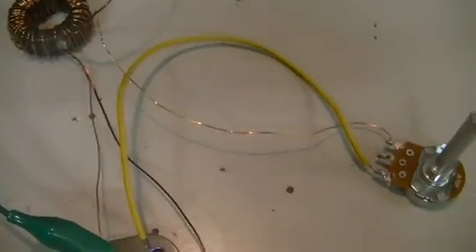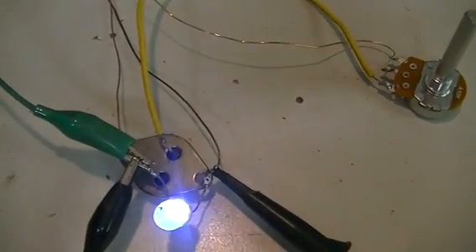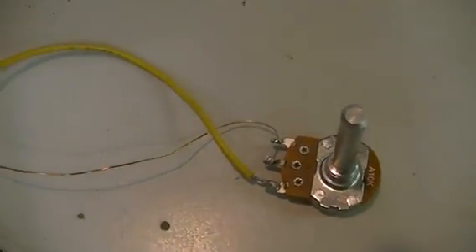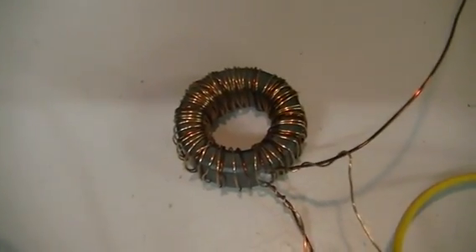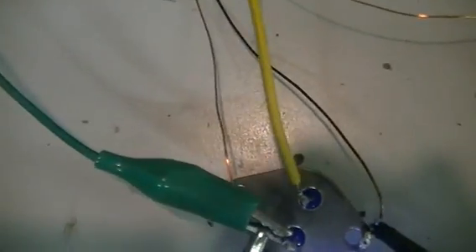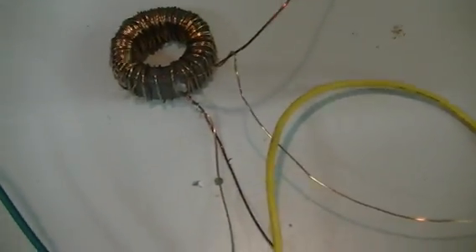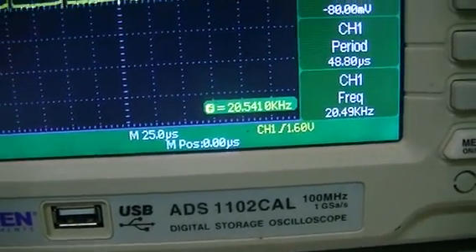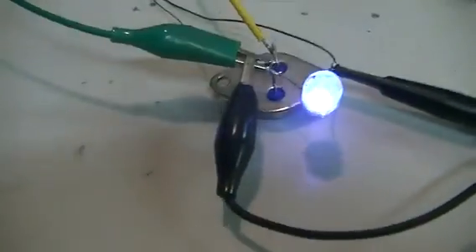Here we have the solid state SSG circuit — plain Jane SSG circuit. I do not have the 100 ohm resistor on the base; I simply have a 10K pot. I'm using the toroid, 8 to 1 turn ratio, the primary being the 1, the secondary that's driving the base and switching on the transistor is the 8. That is so we can bring the primary coil voltage down very low and still have ample to drive the transistor from the secondary. At the moment this one is running very stable at 20.5kHz, and that is a 10mm LED — a large one and very bright, no problem at all.